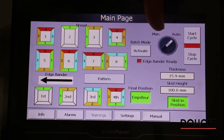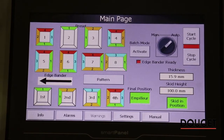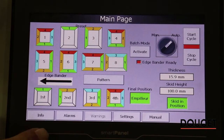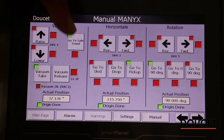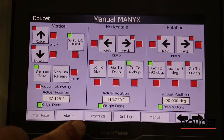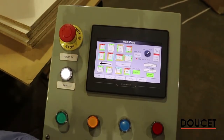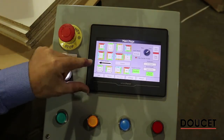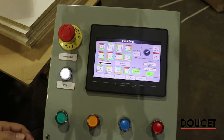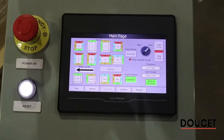There's the batch mode activation, so if you decide to pass multiple panels or individual panels in sequence, we're going to overview that as we go through the demo. You can run everything in automatic or manual mode using the selector. Manual functions are for troubleshooting and zeroing the servo motors. In the manual function screen you can see where the pneumatic valves are located and which status is active, make manual moves, and access all alarm pages. At the bottom of the operator console there are four buttons, color-coded to match the edge passes, so the operator can indicate which pass he's on each time he feeds a panel.